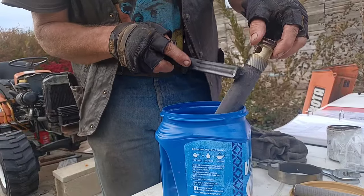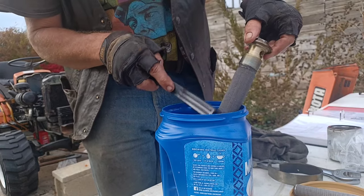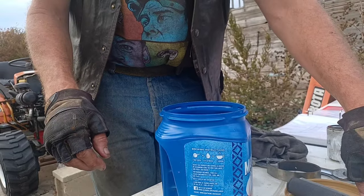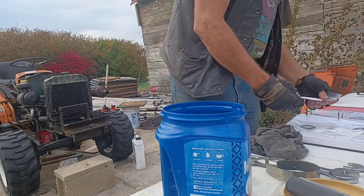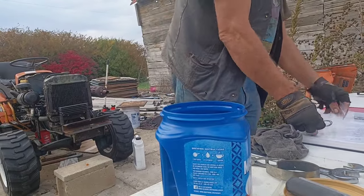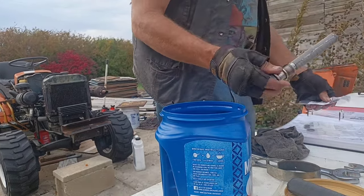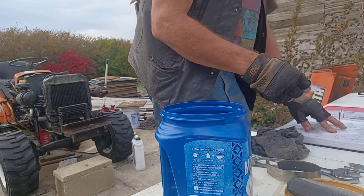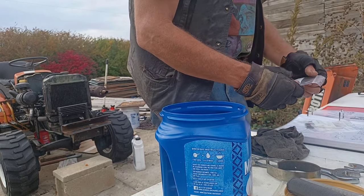Okay, that's pretty well clean. Some of that sparkle is the baffles underneath it. Let it drip dry a little bit. Now as we start putting pieces back together, this is where all those small parts I went through in the beginning of the video come into play. The right-hand pickup screen, or pickup strainer, is clean and ready, so we'll go ahead and install it.